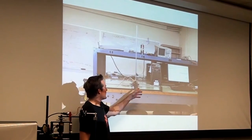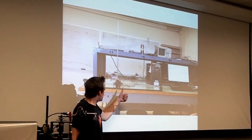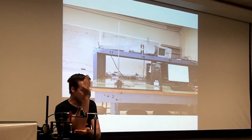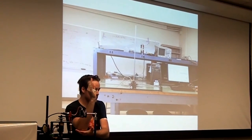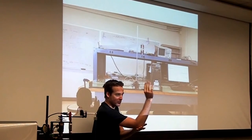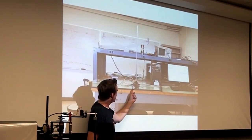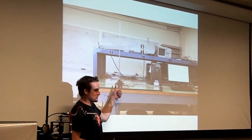But this is it running on MATLAB, essentially the same algorithm. What is different is that this algorithm changes the set point. It is not just trying to keep it here the whole time, but it tries to keep it here for a while, and then 10 seconds later, shift it over by a couple of feet. And then 10 seconds later, shift it over. I want you to notice something interesting. When it's going to move this way, it first moves that way. Watch. Whoa, see that? And then it sort of stabilizes out.